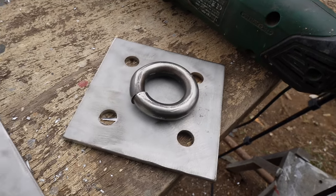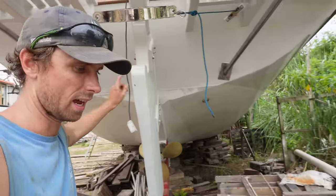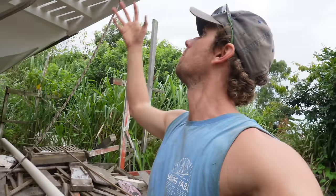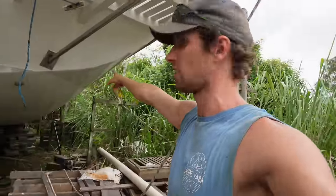We've got our pieces — these are 5mm thick stainless steel plates that we're going to fasten the half-inch rings onto, and that's going to be fastened in the position we chose after much consideration with Alan, there and there, with the possibility to improve it later by changing angles and things. But for now we think it's going to be more than enough, having a straight stay going downwards onto the hull above the waterline. So we're just going to put all this together, fasten all the stays, all the stainless steel wire and tensioners, and put them all in place.